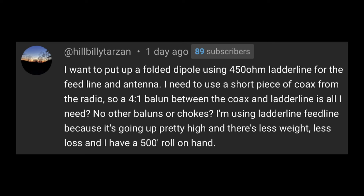I don't know what size you're going to use, so I'm not able to model it. What we would want to do is test the impedance there to determine what type of device you would need. Also, if you're going to be using this thing multi-banded, your impedance is going to change as a result of frequency changes, so it's going to be pretty hard to predict.